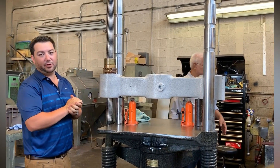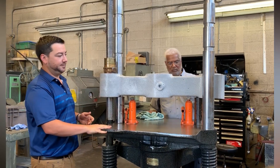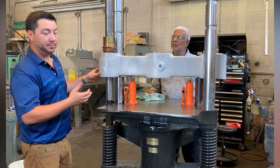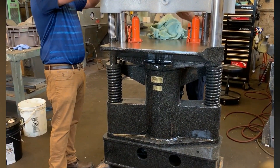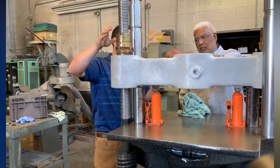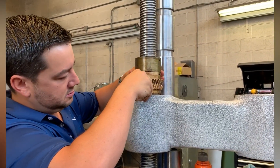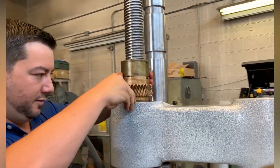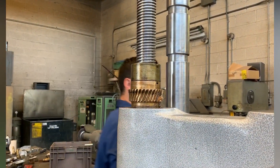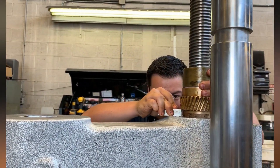This is Carlisle and Jeff over at Frank Bacon Machinery. Today we're going over the assembly of the 60K Satec Baldwin BTE. Putting the first crosshead on here. As you can see, it's all painted separately and then we reassemble with the load nuts coming in. You have to be perfectly aligned, so right now we're setting the alignment before we jack up the crosshead to match our nuts. Everything has to be very, very level.